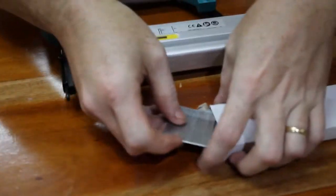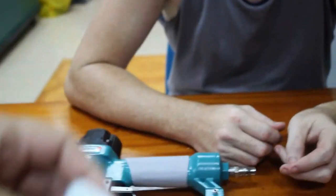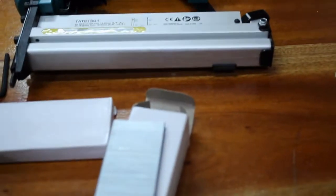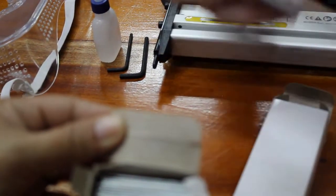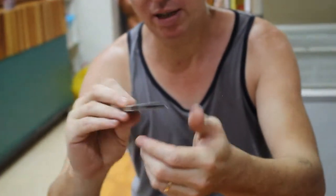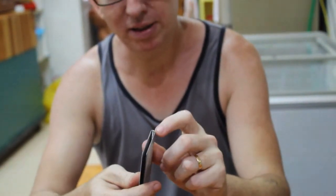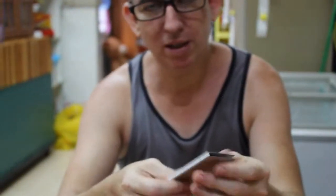There are a lot of free nails in here. You got six staple strips — that's a lot. These staples are very good at holding small pieces of wood together, even larger pieces. The reason they hold better is because the staple curves over and down the other side — you're getting two points of entry plus this U-shape holding it together. So there's no way it can slide back or pull loose. That's why it's good to use staples; use common sense about what to use a staple on.